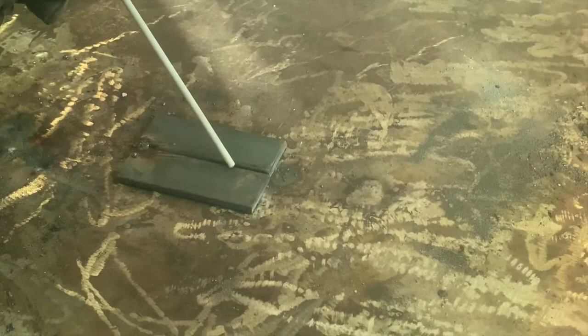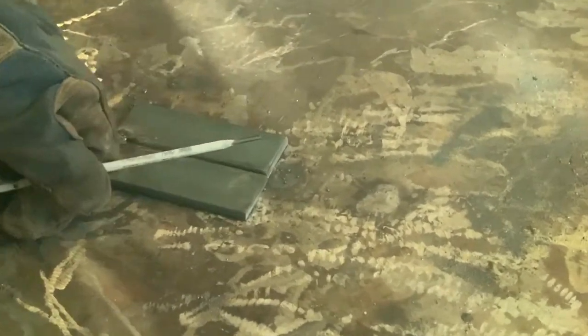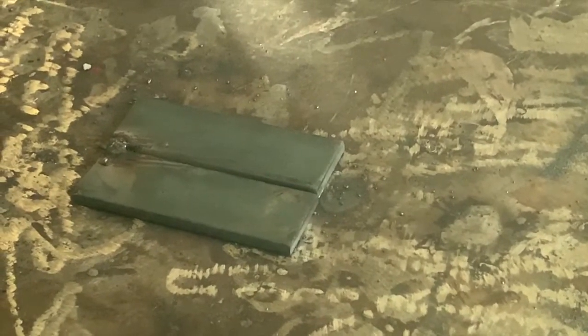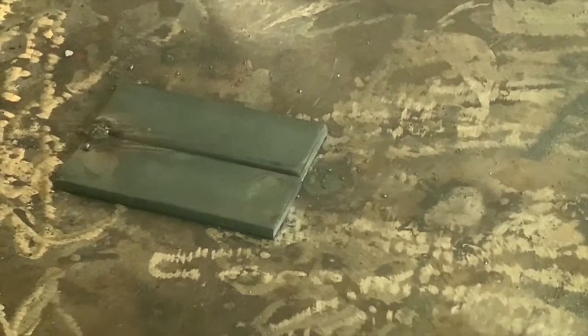The motion I'm going to use on this 1G butt weld with 7018 is I'm going to take the electrode, strike it up, start on one piece and do a side-to-side motion hitting both pieces evenly. I'm going to watch that puddle spread out and as the puddle is building up I'll have forward progress. Just slide back and forth melting the two edges together and filling the seam with the wire core in the electrode. I'm going to run about a 10 to 15 degree pull on this rod.